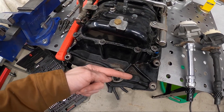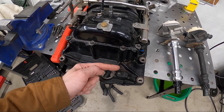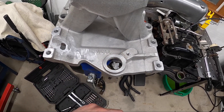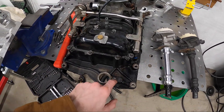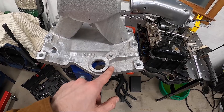I think this is like perpendicular to the crank centerline, but the new manifold is at some funky angle. I was actually planning on just machining this off and machining up a block with this kind of hole, thread and angle, and then welding it on here.